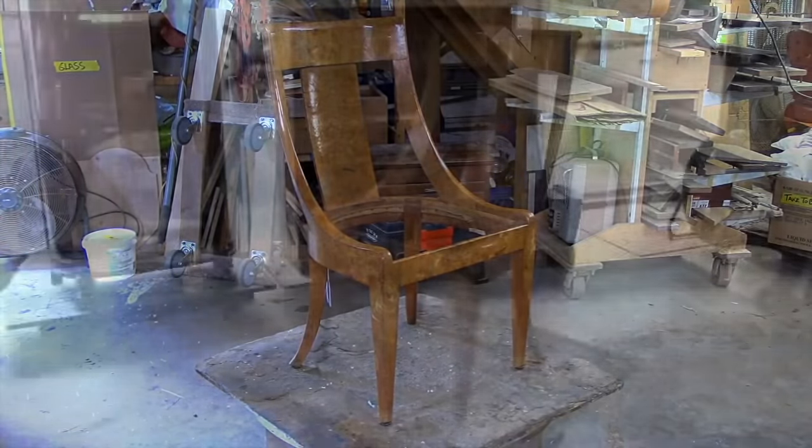I just wanted to get enough film on there so I can sand it smooth. This center section was by far the worst, and it's just shining like crazy right before my eyes. But as I continue to brush it, just gently, tipping it off, it seems to help. So I've just stood here for about 5 minutes, continually tipping it off, and it really looks not bad. Far from perfect, but we'll see tomorrow. Well, this is dried overnight. It's a real mess.